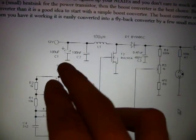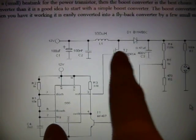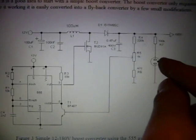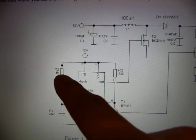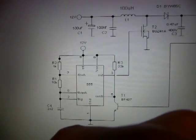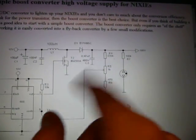Here's the circuit I'm using. We have our inductor here, some decoupling stuff — ignore that. We've got our diode, and taking the place of the switch is an electronic switch, a MOSFET in this case. We have our load over here, which is a Nixie tube — that's the point of this circuit. This 555 here is pumping out a square wave, 50% duty cycle, around 8 kHz. These schematic values are not going to give you exactly 8 kHz — I kind of tuned these values to my inductor by trial and error, because I was lazy and couldn't be bothered to do the math.